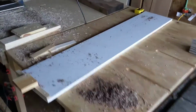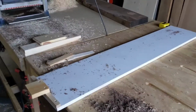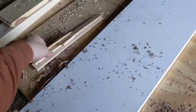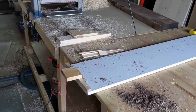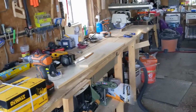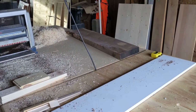And then I needed a jig for flattening some boards in my planer. As you can see, we made a mess. So I built this guy here. At first it just had the one cleat on the back, and I'm just shimming them up to make them level. Not wobbly, and away they go through, flatten one side. So we did that on that maple, which is now flat. Take it off the jig, flip it over, flatten the other side. I just did one side of that board as well. And it worked really well.